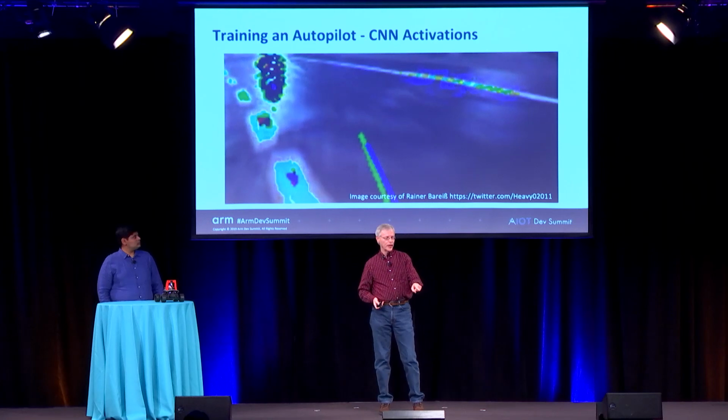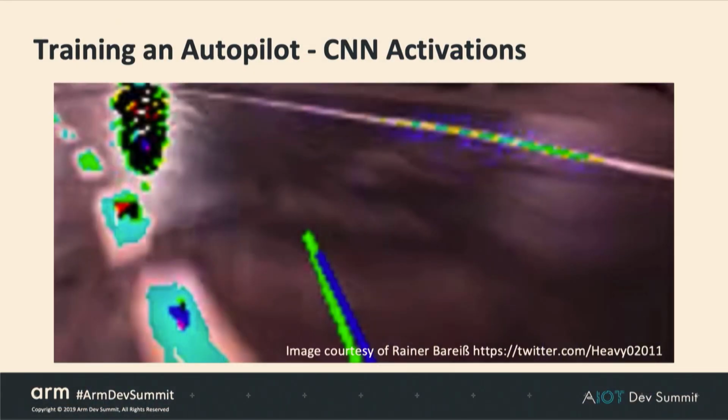Here, there's a glare on the track, and the neural network's really seeing that glare. That's one of the things that can really throw you off. Data augmentation can help. There are also some physical things you can do in the car. Put a filter in front of the camera to try and filter out some of this glare, like you would when you're driving your own car with a pair of sunglasses. But this is a great utility to use to figure out, hey, why does my neural network, when I'm on this part of the track, have that odd behavior?